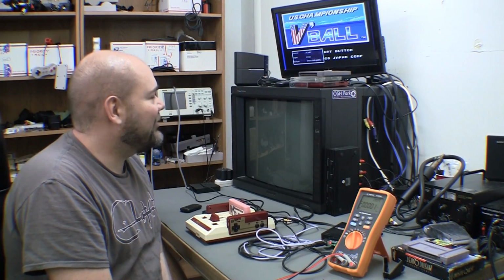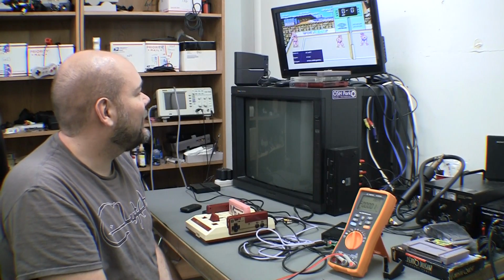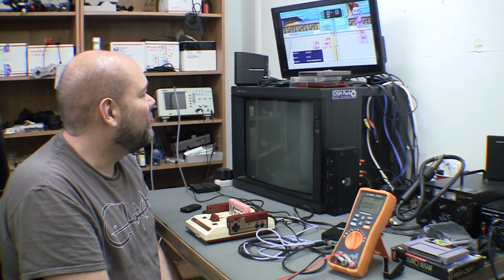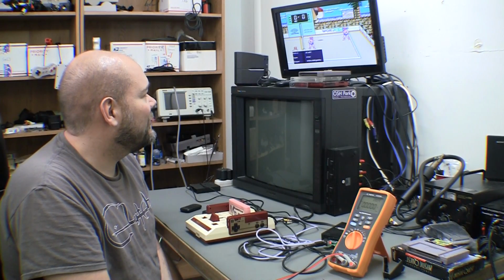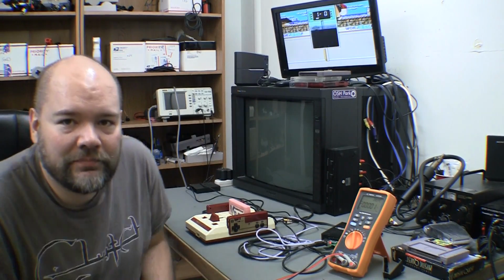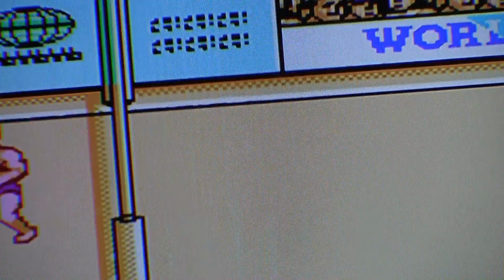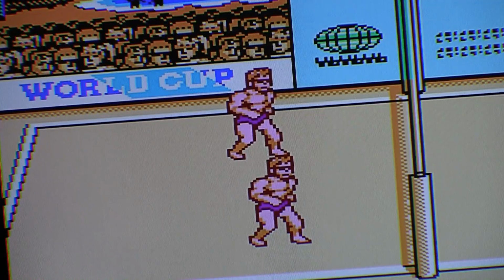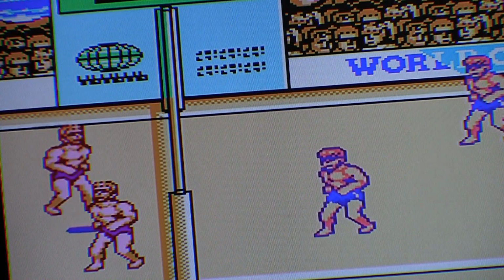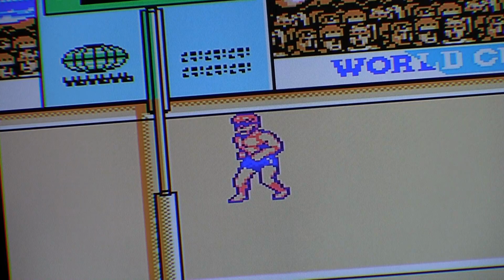So obviously the fix was to put that charge pump on there, and people were right about that pin 16 needing voltage on there. And I will say that yes, it does look much better. I'll get you a close up. Sorry, the TV is sitting on an angle. I'd say it looks very, very good. I mean, for a $50 converter, it looks good. Much better than trying to convert composite to HDMI. Glad we got that figured out now.